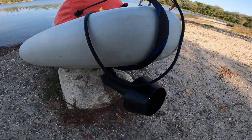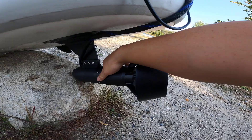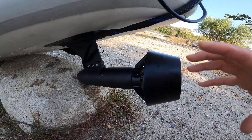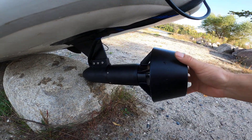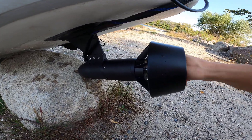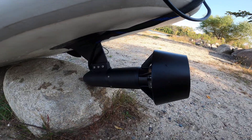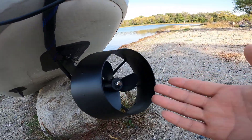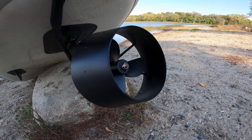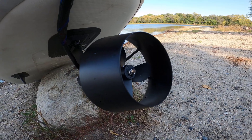To use this motor — sometimes they make a shell that covers the outrunner motor, putting a bigger shell over it to make the motor look bigger and seal the water. But I don't know if this is actually an inrunner motor or just an outrunner with a shell over it. If it's just a shell over it, of course they can only put this small propeller — they can't put a bigger propeller because the motor is smaller inside. To confirm that, I have to open it up and see inside, so that'll be another video.